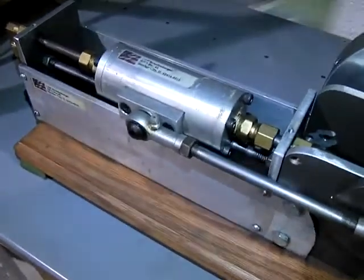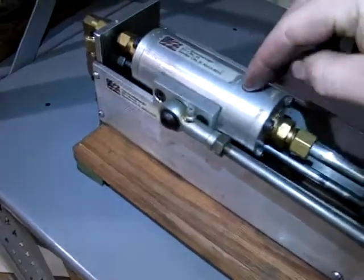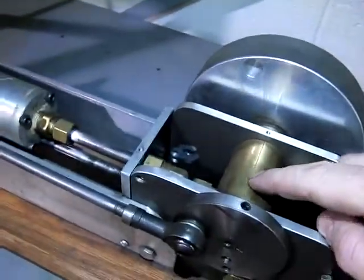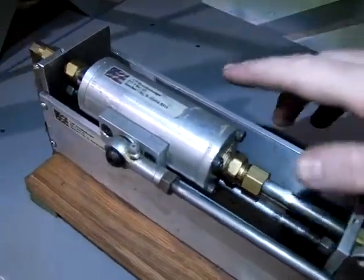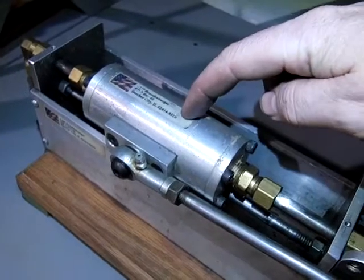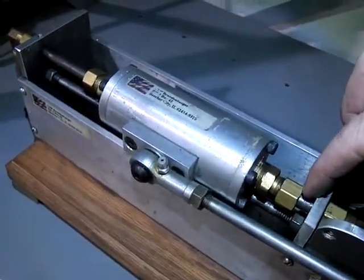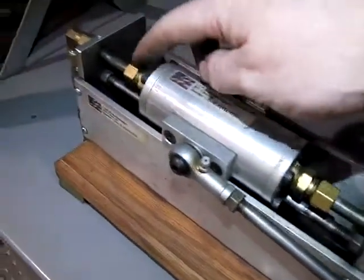The way this works is the piston is in the middle — right now the piston is here. The volume is smallest here. The rotary valve shoots the air through the tube, and it starts to fill that chamber up. The piston is stationary, and the air comes into where it's expanding, and then that side exhausts while the opposite side is being filled.